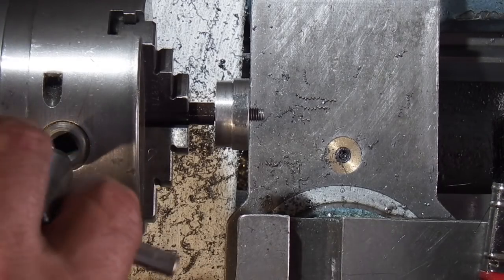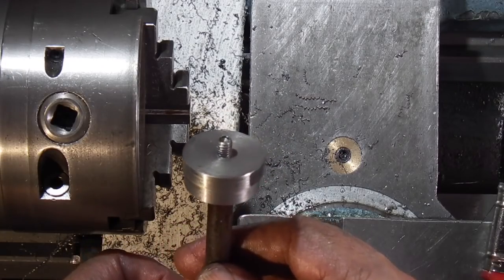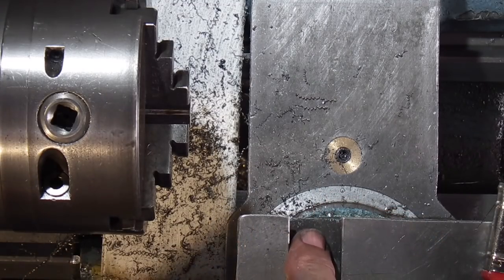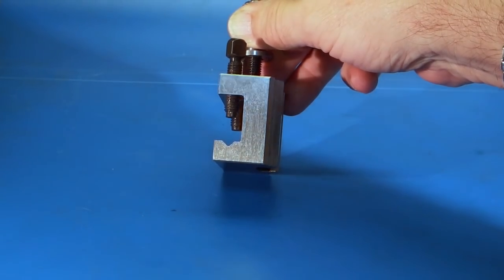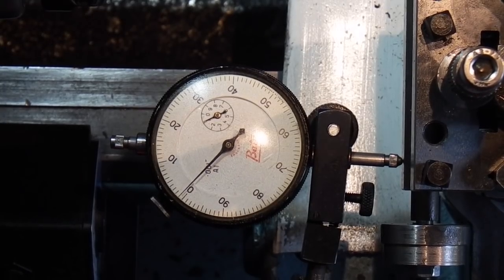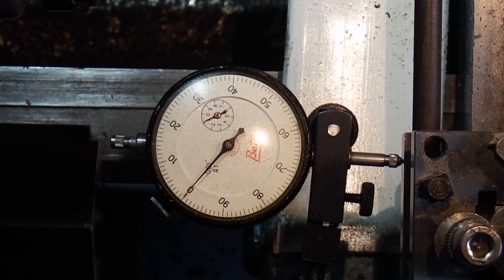I've made a small threaded mandrel to hold the nut I'm making, so that will be held in the lathe and I'll mill two flats on each side to stop it turning in the T-slot. The tool holder I'm using has a V on the bottom so when I put the round bar into that it will centralise it, and I'm using these two clamping bolts to clamp it in position. I'm just setting my tool holder square — I've done that by putting the dial indicator on the edge of the tool holder and running it across. It's within a thou over about four inches.